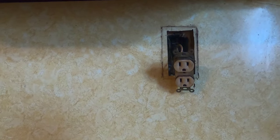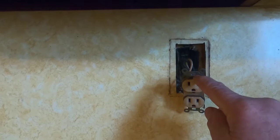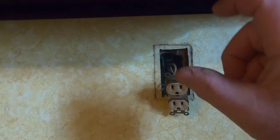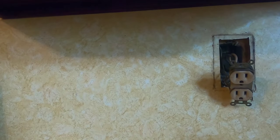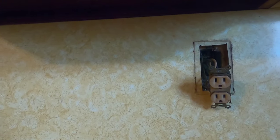When this house was built, GFI outlets weren't around yet, but they did have GFI circuit breakers. I have a GFI circuit breaker in the garage that connects to one of the kitchen outlets, the outside outlet, and the bathroom outlets — but those were all working and had power. He said go check that breaker.